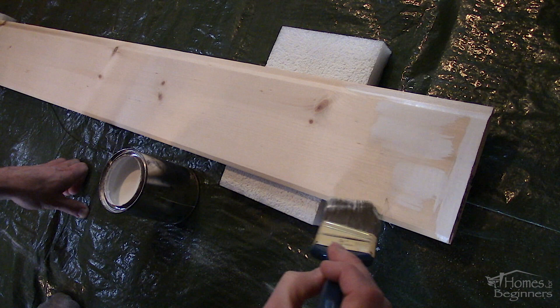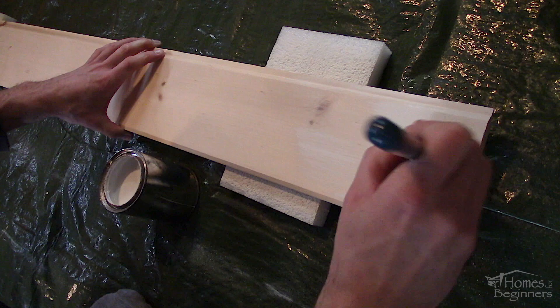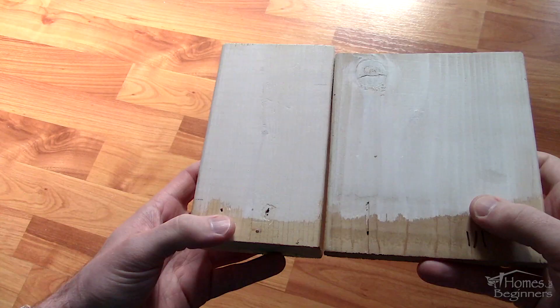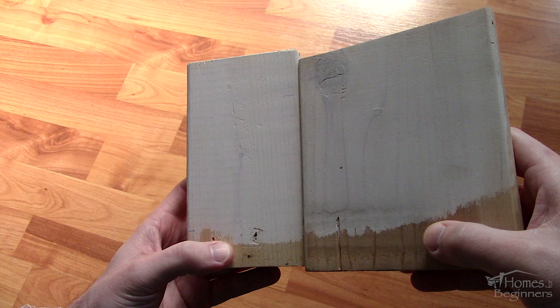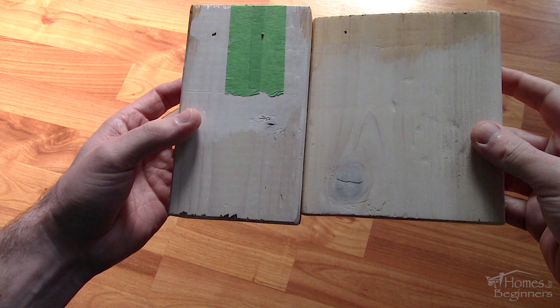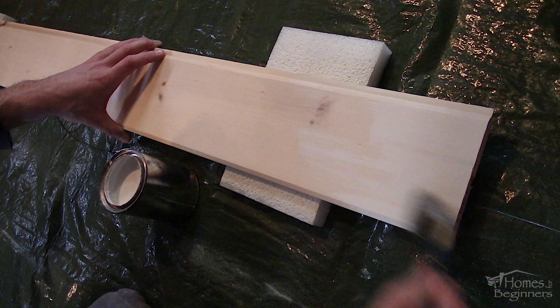The paint is mixed at a 1 to 1 ratio, so that's equal parts water and paint. Mixing ratios can vary depending on what type of finish you're looking to achieve. More paint will mean less grain showing through; more water will mean more grain. Here are a couple of test samples — one using spruce on a 2x4, and one using cedar on a 1x6. You can also see the original wood finish alongside the 1 to 1 ratio sample. The other side has a 2 to 1 mixture, meaning 2 parts water and 1 part paint. Don't mix the paint by eye — if you need more mixed you won't be able to achieve the same finish. Make sure the paint is mixed before application.